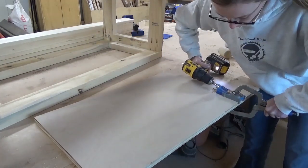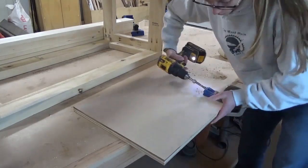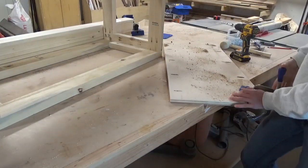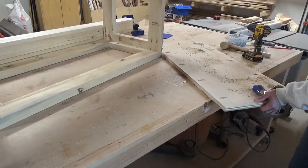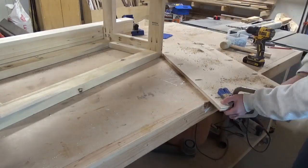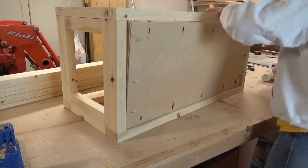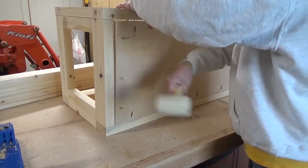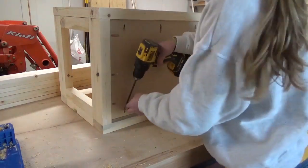I like having the R3 jig for working around large pieces of plywood or for really long boards, but I like having my K4 or K5 pocket hole jig for smaller pieces and shorter boards. If you're in the market for one or both of these pocket hole jigs, check out the deal that Kreg is offering right now in the description box below — they've got a pretty awesome package deal on the K4 and also a $15 rebate on select jigs. Once I had the holes drilled along the edges of the bottom, I installed it into the frame as shown using 1.25-inch pocket hole screws so that it was about one inch from the bottom of the box.